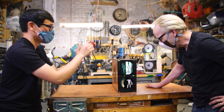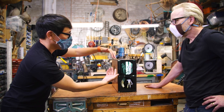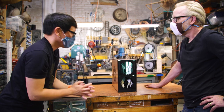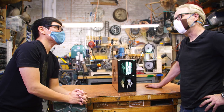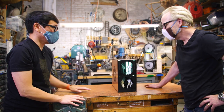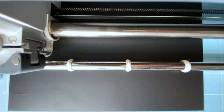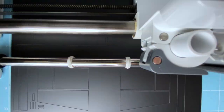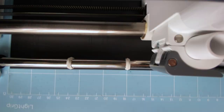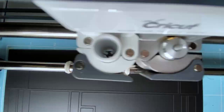Something you showed me a while ago — acrylic cement — that's what holds this whole thing together. Just capillary action. It makes these slot joints, makes them one piece. And the relief here is all 0.02 styrene. It's a little stinky. The styrene is cut on the Cricut Maker — vinyl cutter, three passes with the blade, pops right out — use a little bit of Tamiya thin cement. Sticks right to acrylic. The Weldon 3 will glue styrene to acrylic all day long.